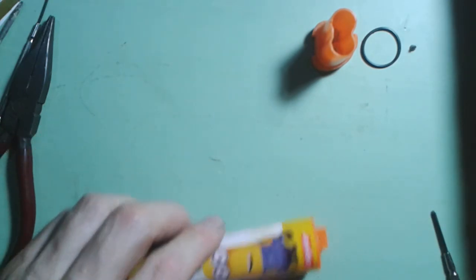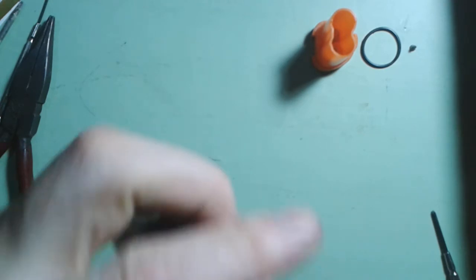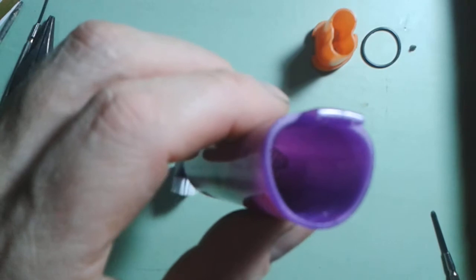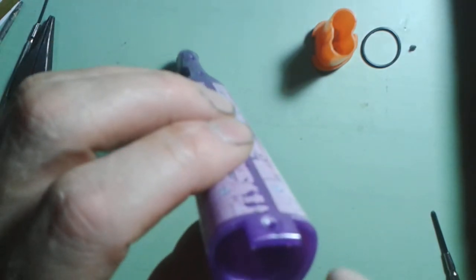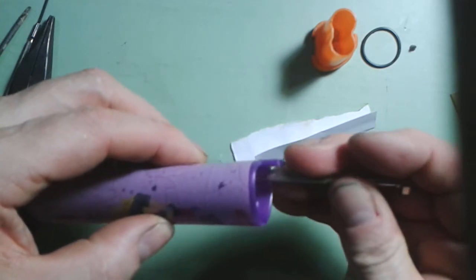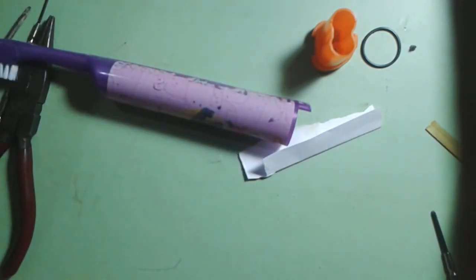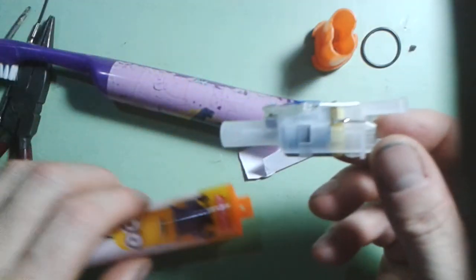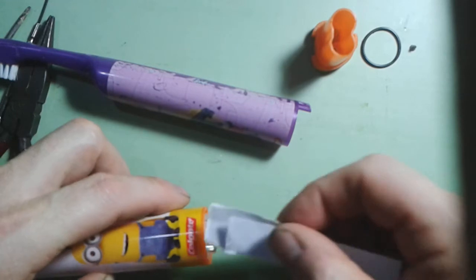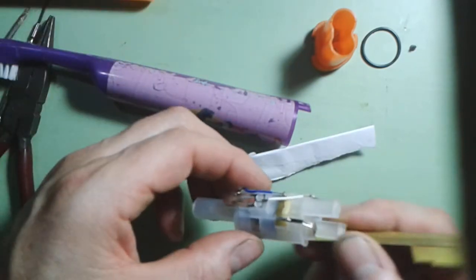Inside you will see the motor and the gearbox; the other bits of plastic are in there too. There are some really tricky little clamps in there that you need to get out — if you poke a screwdriver down here, you can pull the clamp away and force that behind it, stopping the little pincers on the motor from holding it in. The motor unit will then slide out the end. You need a little bit of card or plastic on either side to allow those parts to slide out, and that brings the whole motor unit out.